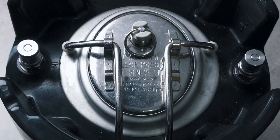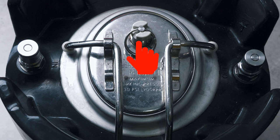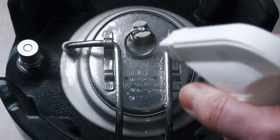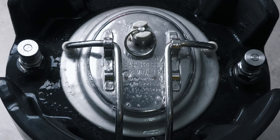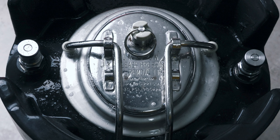Then you should put the whole thing back together again, add water to the top fill line and then add pressure. There are now four areas of the keg where we need to check for leaks. Firstly these are both of the posts, which includes the outer area where the post is screwed into the keg and also where the poppet forms a seal in the middle of the post. In addition to these two areas you must also check the entire circumference of where the lid joins the keg. And lastly check that the all-important pressure release valve has no leaks. The easy way to do this leak testing is to spray the area you are checking with either diluted foaming sanitizer, soapy water or a purpose-made liquid leak detecting product like Snoop. If you see enlarging bubbles then this is a key indicator of trouble and you will need to take action until it is resolved. You will want to be doing these tests before you end your maintenance ahead of transfer of your homebrew.